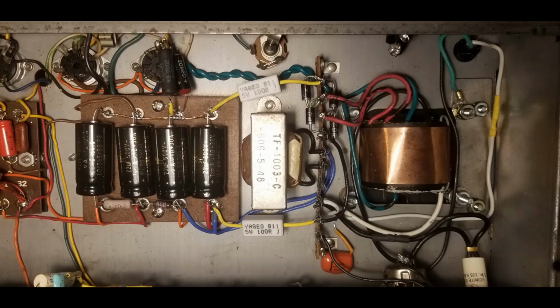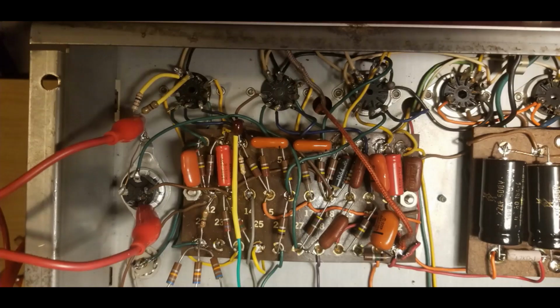I had mentioned that I had only got the loudness volume gain up to 3 before it started to distort. And it wasn't all that loud, honestly. So it means that I'm pushing a lot of mids, is what that means. So what I have to do is either reduce the volume greatly, or the low end, which is what Gibson did. They took all the low end out of it so it wouldn't distort at 3.